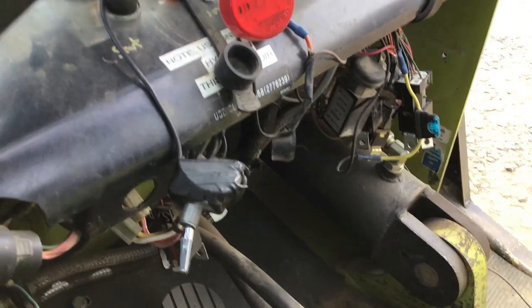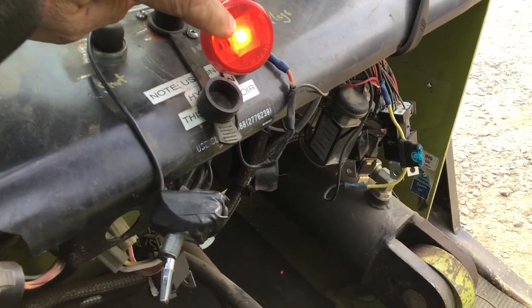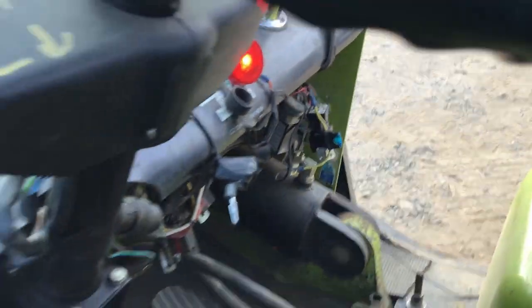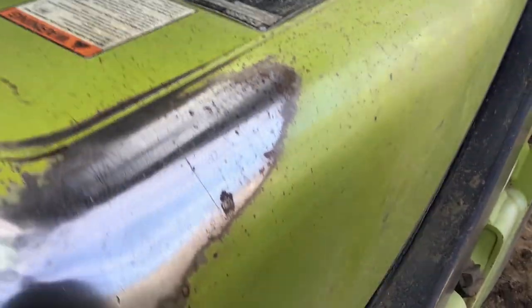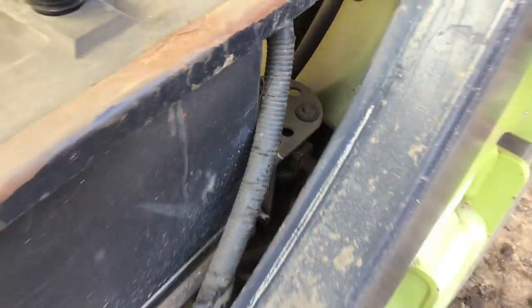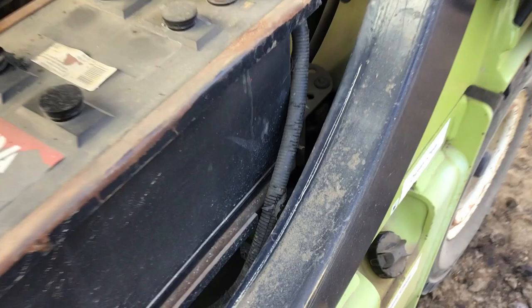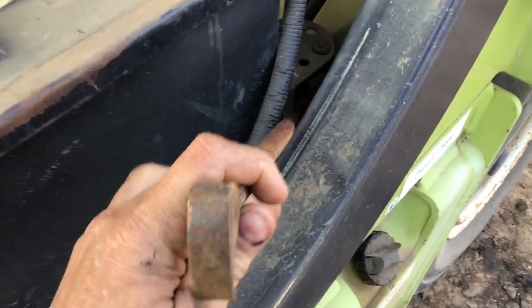The first thing you do — it's going to be a little awkward here. This is more of a video for the guy calling to get it started. Turn the key on; that light being on means it's going to start — that means power to the injection pump. Under here we have an electric fuel pump, but it has issues. So if you don't hear the fuel pump, you reach in and give it some love taps.